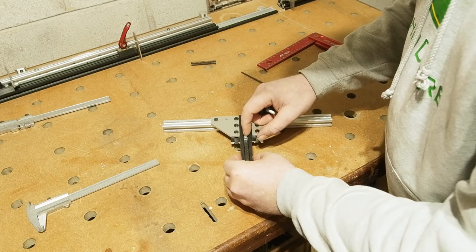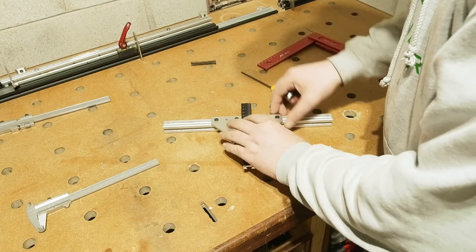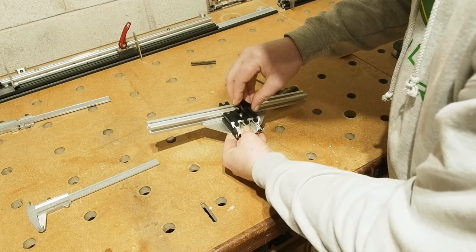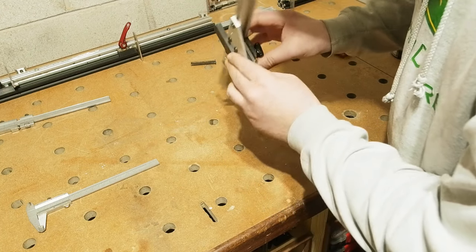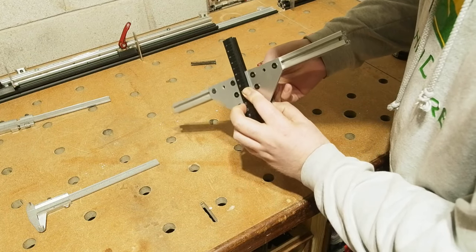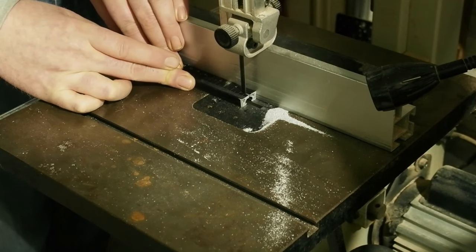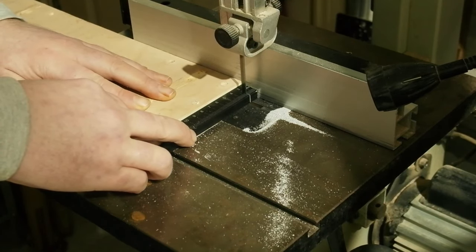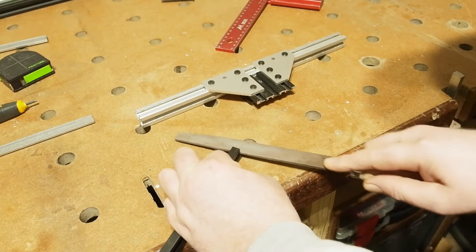The beauty of this old under rail piece is it still has the 6mm slot underneath, so in goes a T-nut — M6 this time, as the only suitable star knob I had was M6, one of the ones that actually came originally with the fence. I'd pre-drilled the hole in the 2060 profile for the star knob to go through. The slot on the underside of the Mafell and Bosch guide rails is a tad over 7mm — I cut at 8mm on the band saw, then it's a matter of filing the pin a little at a time, checking after every few strokes against the rail until you get a perfect fit.